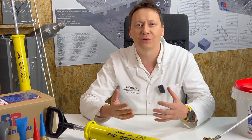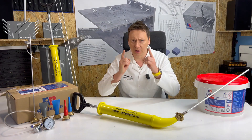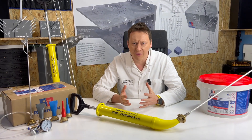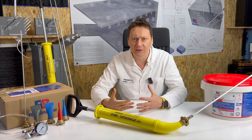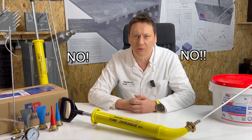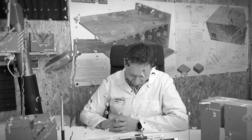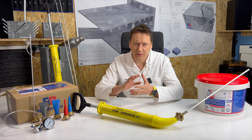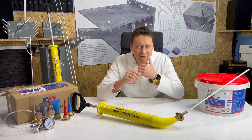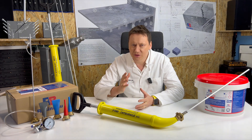This is the perfect time to clean the holes. A crucial step is cleaning the injection holes. Some people use a vacuum, not just for maintaining cleanliness on site, but to clear the dry or wet drill hole. Unfortunately, this method doesn't clean the hole effectively. Residue left deep within, combined with the resin, forms a mess that prevents thorough penetration into the crack, making the injection less effective.